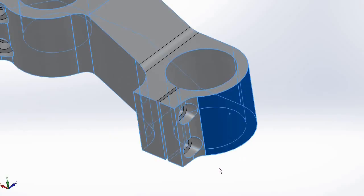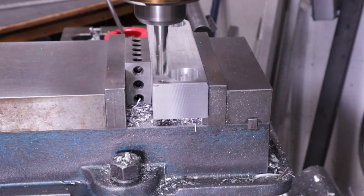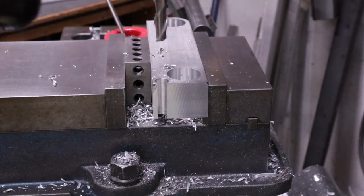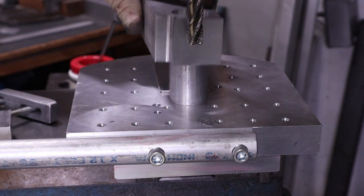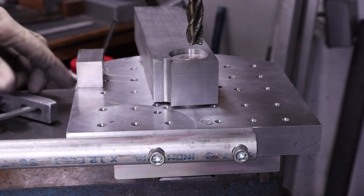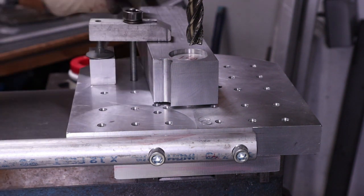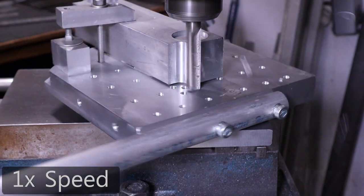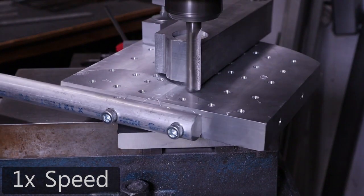To do this outside radius on this triple clamp that I'm making, I first pre-drill the endpoints of the cut using the digital readout. That way I don't need to make any type of degree measurements in the rotary table. I then put it in the rotary table, and with the centering pin it only needs one toe clamp to hold it. With the endpoint pre-drilled, this radius takes less than a minute to cut. This is an inch and a half wide cut with a half inch end mill.